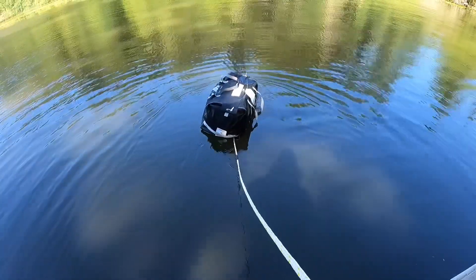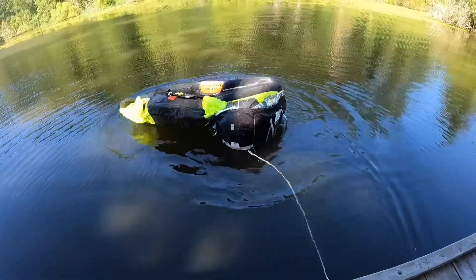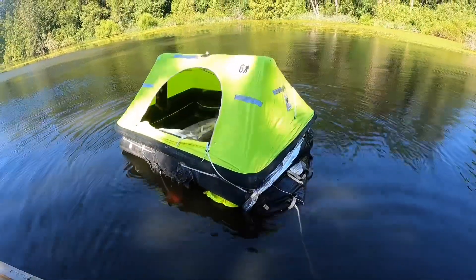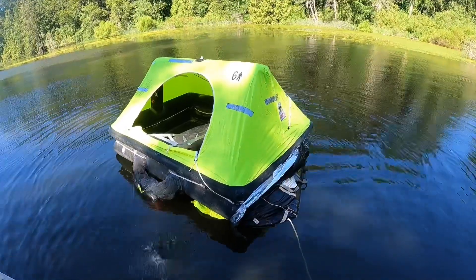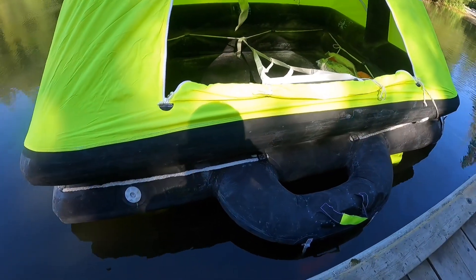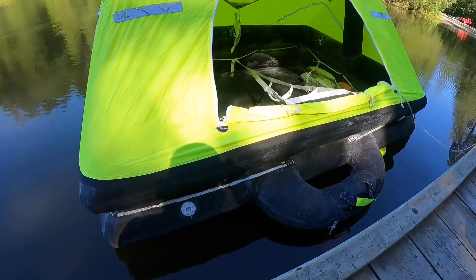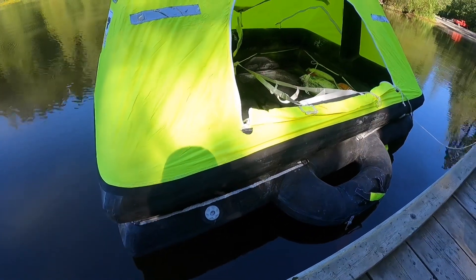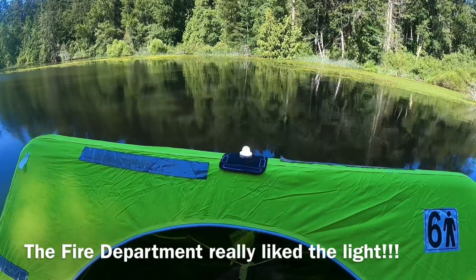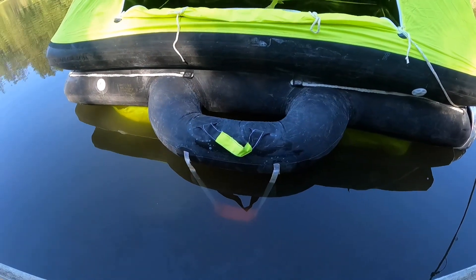Okay, let me give it a firm tug. You can still hear some hissing and that's okay — it's actually because the canister that inflates the life raft has too much pressure in it and it's releasing that pressure right now, so it's not the life raft leaking. There's a nice little flashing light up here on the roof of the life raft. This particular raft also has a ramp, which makes it a lot easier to get into.